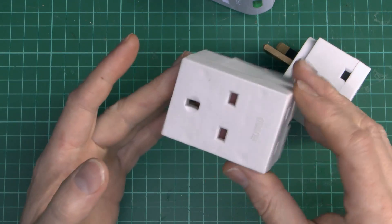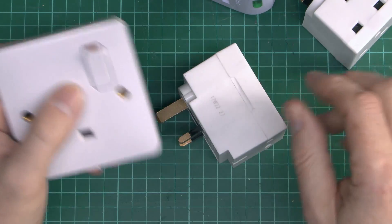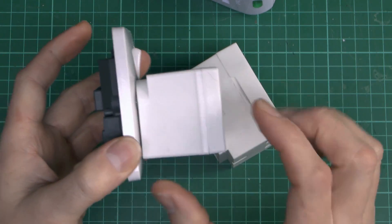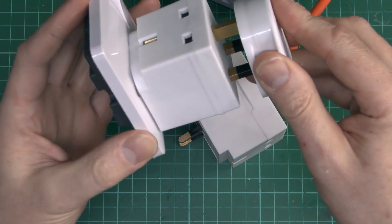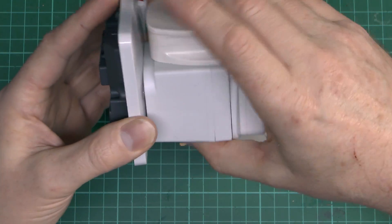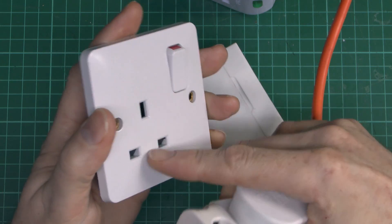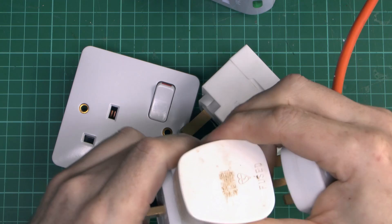These are quite commonly available and very cheap — only a couple of pounds each — and pretty much available anywhere. As I say, the unfused ones do have a problem, and the other problem is when you plug them in, they stick out from the wall a very large distance, and then you've got your plug to add into the mix as well. Very quickly you get this huge block hanging out of the wall. Knock it in the slightest and it's going to put a huge amount of strain on the socket and quite often break those out of the wall — that's aside from the overloading issue.